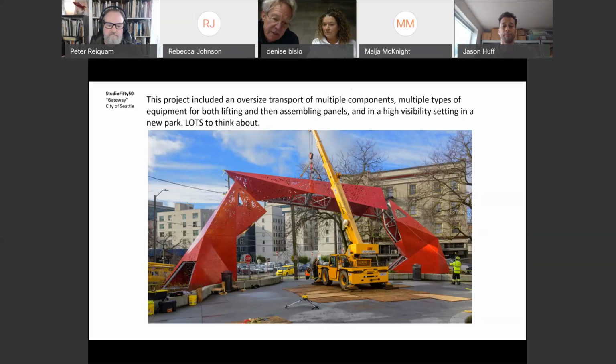My point is, it's sitting on an island of plywood. What the artist also needs to recognize is that, trying to keep within your budget, how do you move that plywood? Where do you get it from? This plywood doesn't come from just the local lumberyard, but it could be masonite, it could be cardboard. The fact remains, we figured how much plywood we needed, and then we leapfrogged it. We offloaded it, stacked it, and then leapfrogged it from the entrance to the present site where the crane's sitting. And as the crane moved, we would leapfrog the plywood.